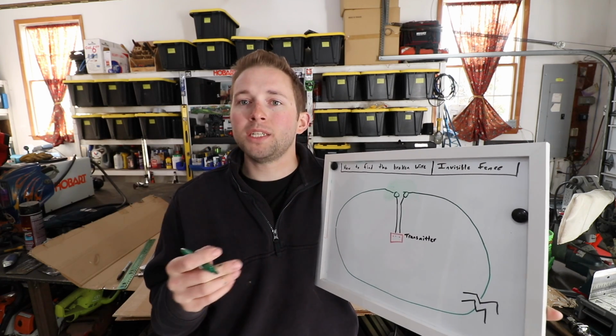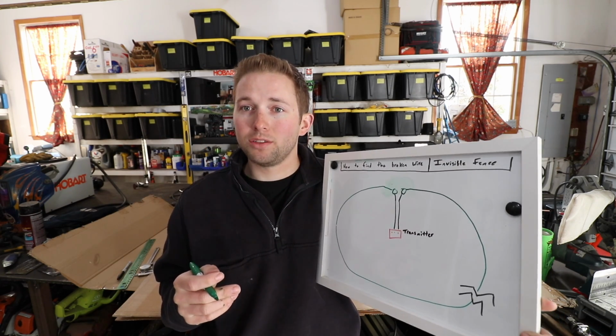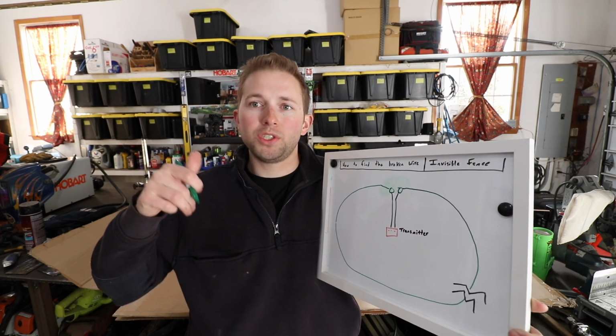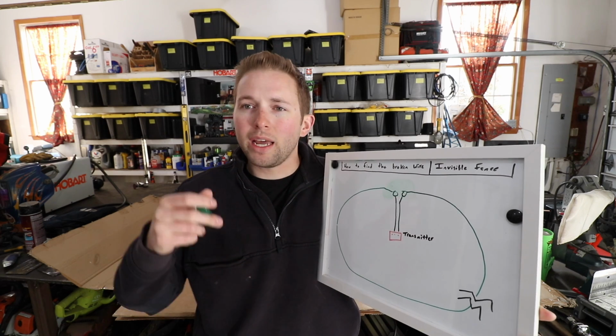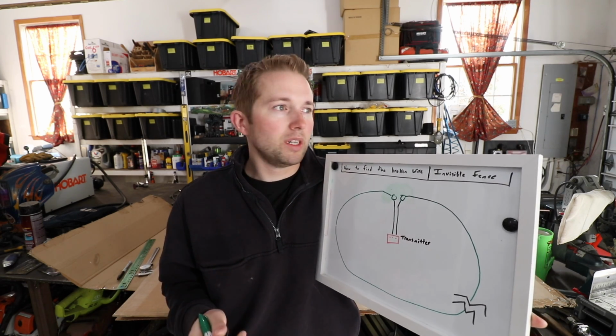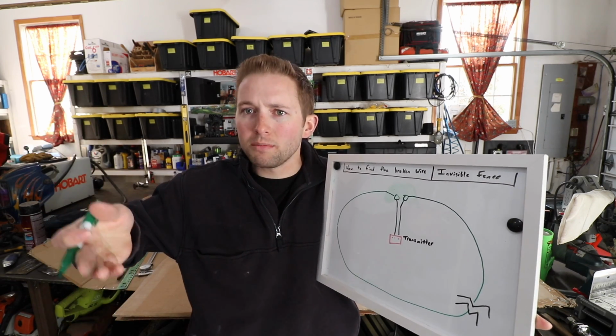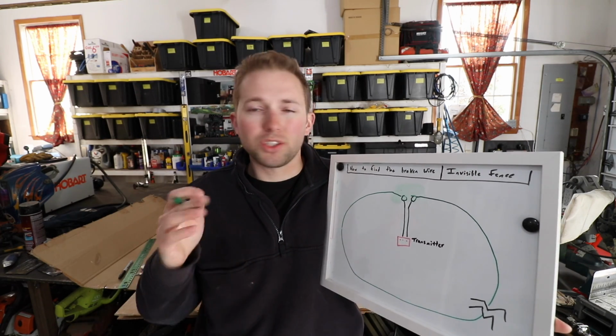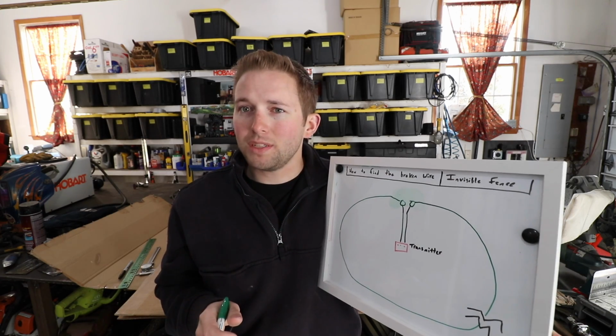Go around your property and do a visual inspection of where that wire is, or where you think the wire is. Try and make the determination if that ground was recently disturbed in any way. And also look at your high traffic areas. So did you recently edge your garden bed? Perhaps you hit that line with a shovel and you broke the wire there. Is there an area where you constantly go over with an ATV or a tractor?